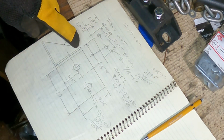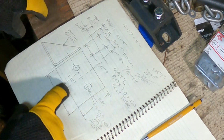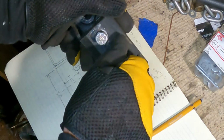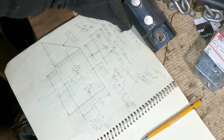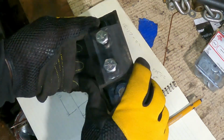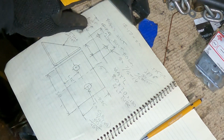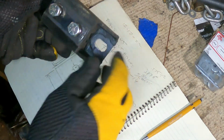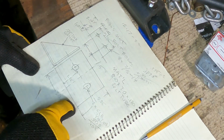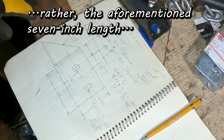And then what I'm going to do is add some 1/8 inch thick gussets to the sides and drill the 2 holes to match the 2 bolts. And what I've decided to do is, since these are 7/16 bolts, I'm going to drill 1/2 inch clearance holes. The 1/2 inch holes will give me a little bit more wiggle room. So first, let's go grab some 2 by 3 by 1/8 wall tube, cut us off a 3-inch piece, and then slice it to these dimensions. Cool.